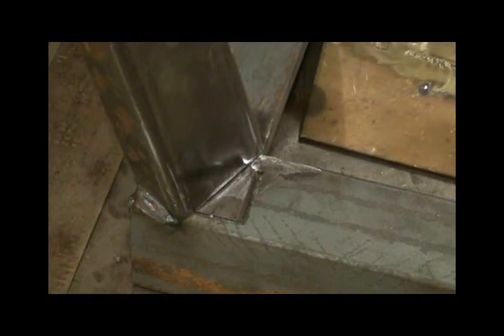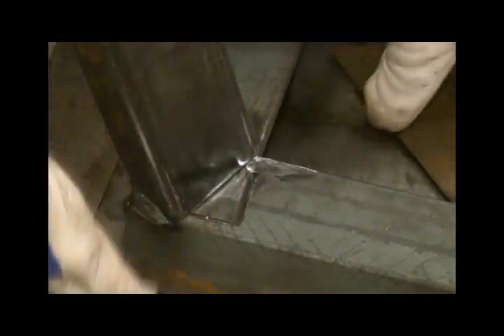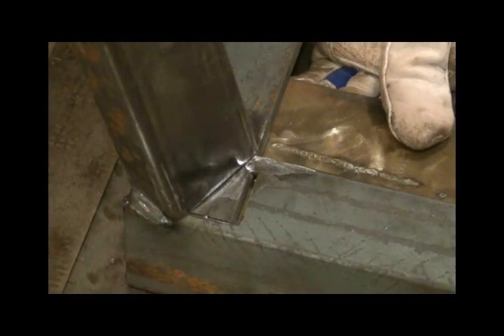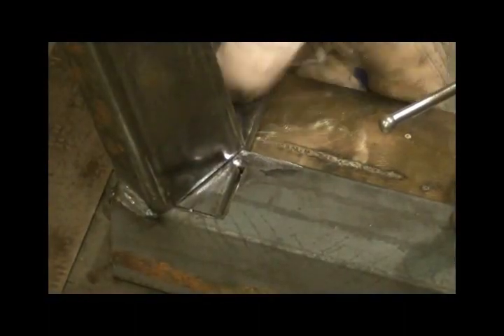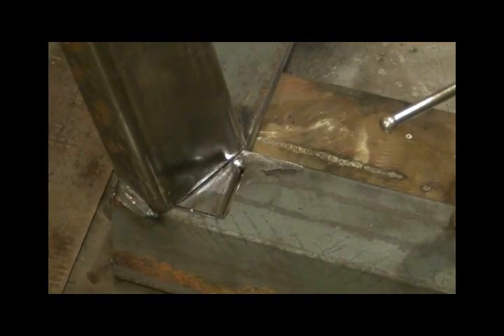There's a bit of a gap right in here, and I don't want my weld to go down and make a bump that we'd have to grind on the other side. So I'm going to get a couple of C-clamps and clamp this piece of brass on there to keep that weld from glooping down. Put a clamp here and another one over here — I think that might be good. I'm going to weld that now and see what it looks like when I'm done.